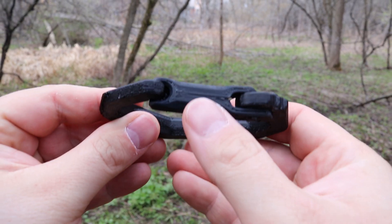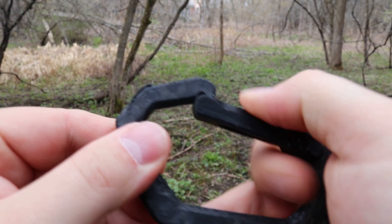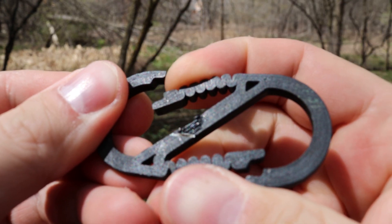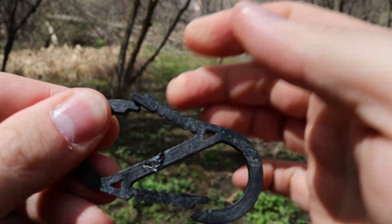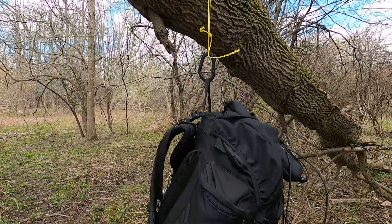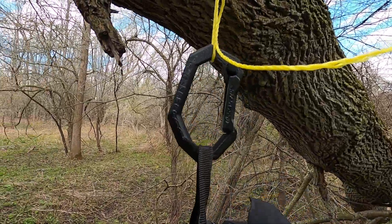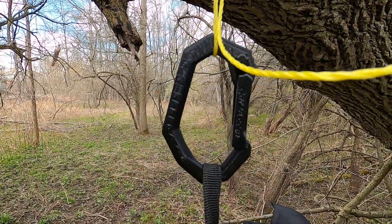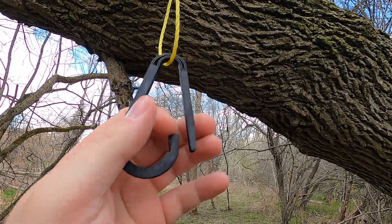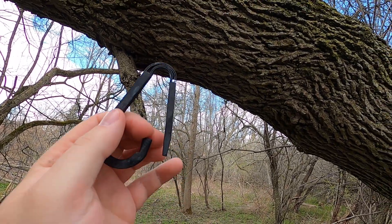On this project, there were definitely a couple of lessons learned. One major thing I learned is that in order for the carabiner to be secure holding anything, it needs to have some sort of locking mechanism on the gate, especially if the design has a spring in it for flex. Otherwise, it's just really easy to misalign the ends of the carabiner and things can just slide right off. But the locking mechanism would also play a major role in the structural integrity. With the final design I tested, it wasn't just the size that mattered — the fact that the nose held a firm grip on the gate from the direction of pull made so much difference. It was definitely the clear winner of this experiment. In fact, I would argue that's probably the most important design feature, as it seems to be the only way a 3D printed carabiner can hold any meaningful amount of weight and prevent losing whatever it's holding on to.